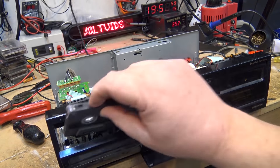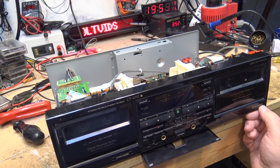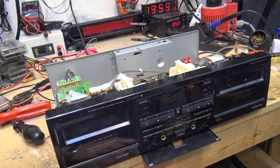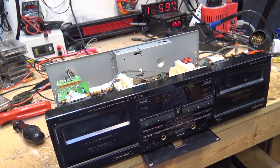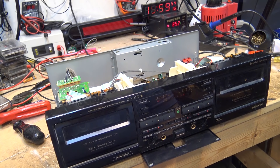I've got the unit set to record. I've already set my recording level. I've got a good old Sony Type 2 high-bias tape and I'm setting my recording so that I'm going to record at a peak of about plus three. I've got my Dolby C noise reduction turned on because I want the best quality I can get. As you can see, this deck features HX Pro — so that's the headroom extension — plus Dolby C. To record, I just press record, and then to record in the forward direction I press forward, or in the reverse direction I press reverse, because this is auto-reverse and auto-record in both directions.